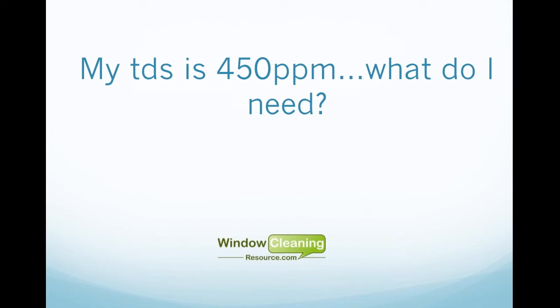choice for you. Now the way you have to look at it is, when you look to purchase a system, you have to decide how often you are going to be using the system, what you are going to be using it to do, and how cost effective it's going to be. So in a case like that, you could clean windows with deionization, and it would bring that water down to 0 TDS. But you would use so many ions per cleaning. So you would be changing your resin out quite often with that high TDS.